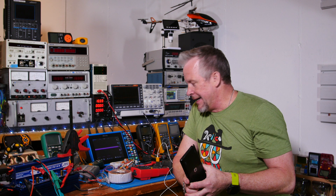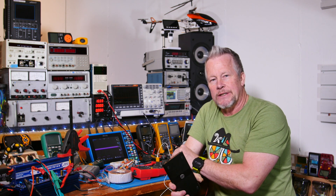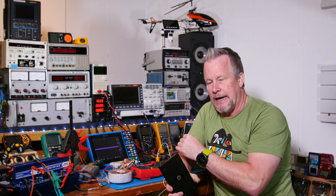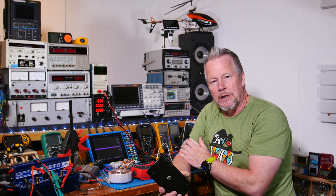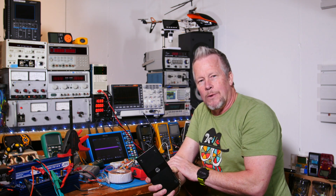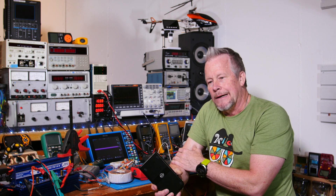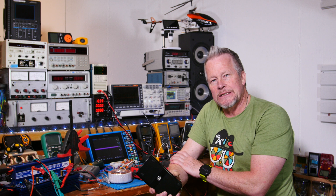I've got a resistor in here that's a problem, and there's no reason for it to burn power. There are three resistors actually — they're in parallel. Three 1k resistors on each side, so 333 ohms, and they discharge these capacitors we put on the board. I thought that's pretty cool — they look like at least 2 watt, actually 3 watt resistors. But I didn't understand why they needed three 3 watt resistors just to discharge capacitors.